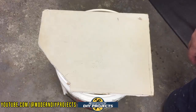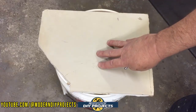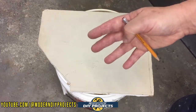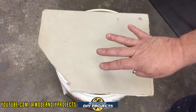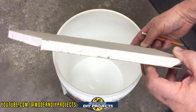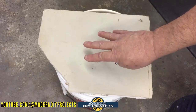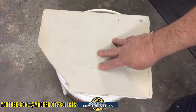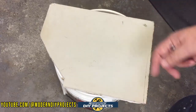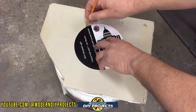Let's figure out the mounting. I'm going to mock it up on this piece of drywall because if I installed it on the ceiling or a soffit the camera angles would be harder to see. I have a piece of 5/16 drywall here — these lights say they can be mounted on any material from very thin all the way up to very thick double drywall. What you do is start off with your template, place it exactly where you want to mount your light, and trace it out to make it easy to see.